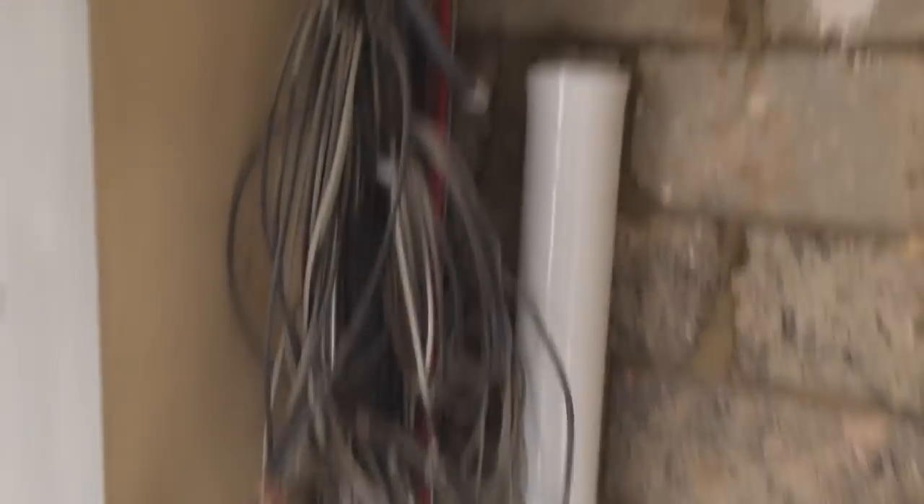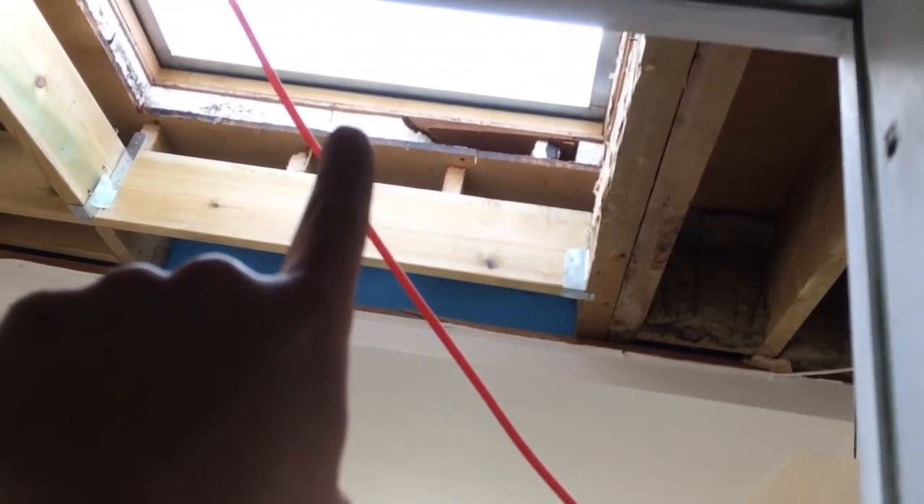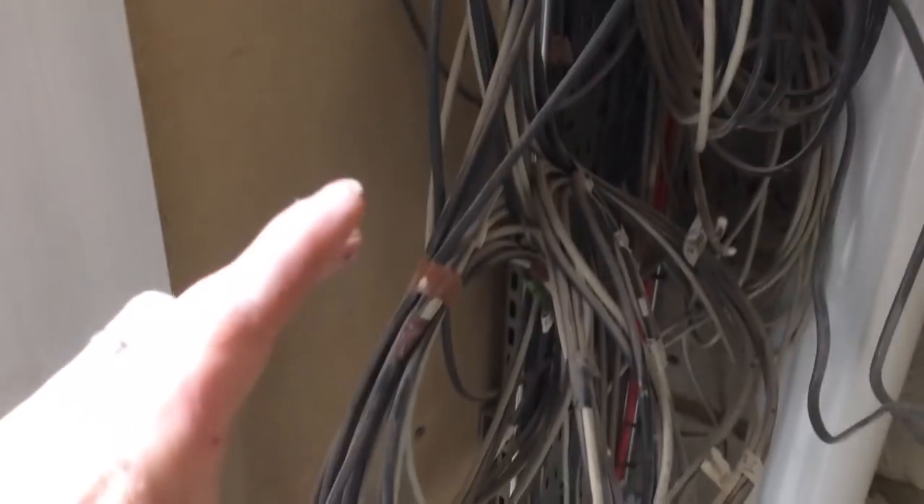While I'm here, may as well show you this is like a riser cupboard that runs up the two floors and then up to the roof. This is where we've brought all our stuff. We've got a tray in - a 12 inch tray. Armoureds. And then you've got aerials. All the door access stuff is going to go here. Damper for the smoke vent up there. Power pack. And the satellite - all the satellite stuff will come in here. You'll have TV amplifiers, satellite switch box, stuff like that.